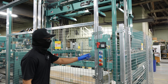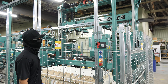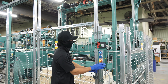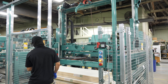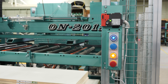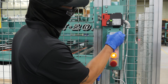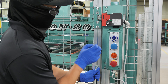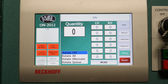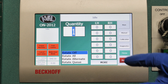When you're ready to load doors, you'll want to hit the request access button. It'll bring your gantry over and down so it's in a safe position, and this green light will illuminate when the gate is unlocked and ready to open. After you have your door stacked in, you'll want to close your gate, release your request access, and also hit your reset. When you're ready to enter in your number of doors, just put in the quantity and hit start.